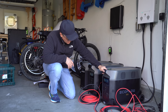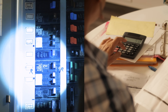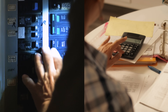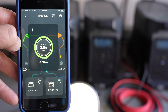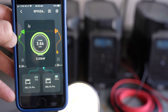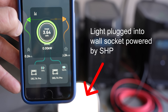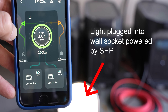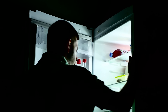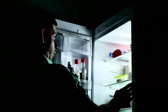Use Cases. As mentioned earlier, the Delta Pros connect to the Smart Home Panel, providing power for either an emergency or for power arbitrage purposes to save money on your monthly electrical bill. If the grid goes down, EcoFlow's Emergency Power Source, or EPS, provides power nearly instantly in just 30 milliseconds. As shown here, the light in the background is plugged into a wall socket, and after shutting off the main breaker, it doesn't flicker. Most household devices will do fine with the EPS, but that's something you need to be aware of in case you have sensitive equipment like computer servers.